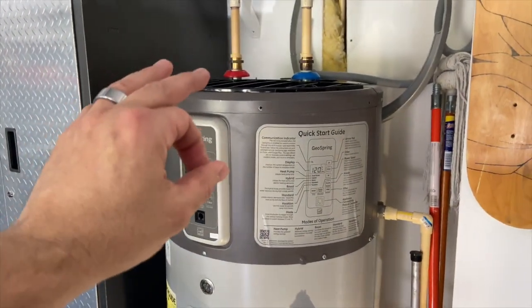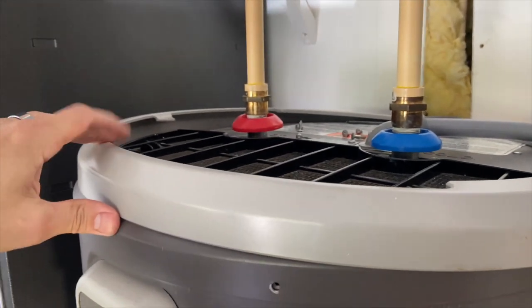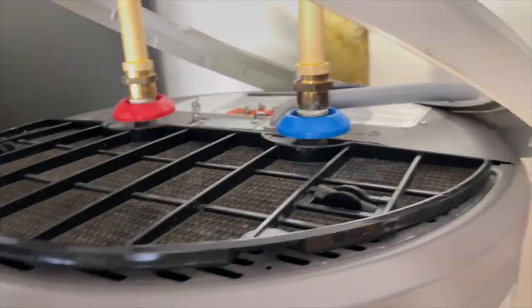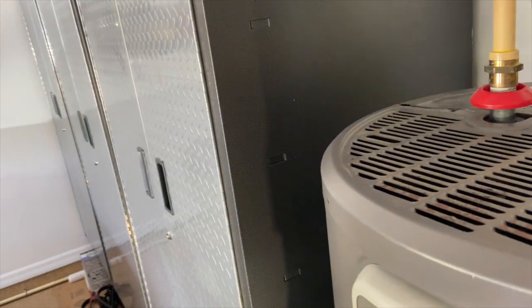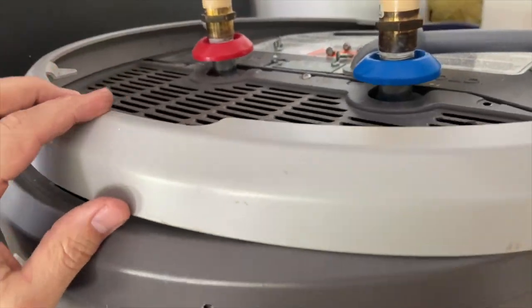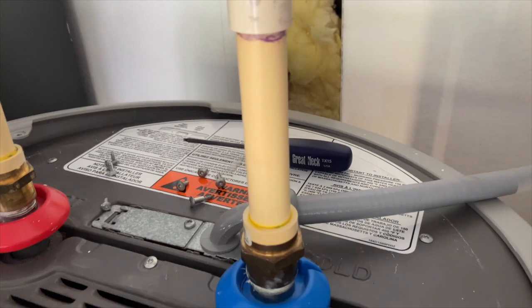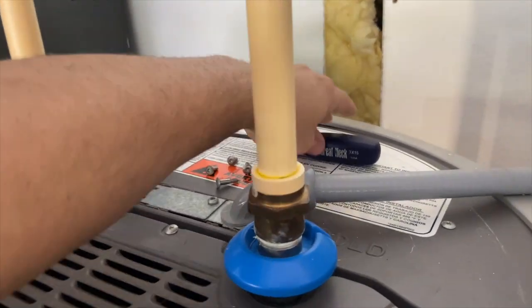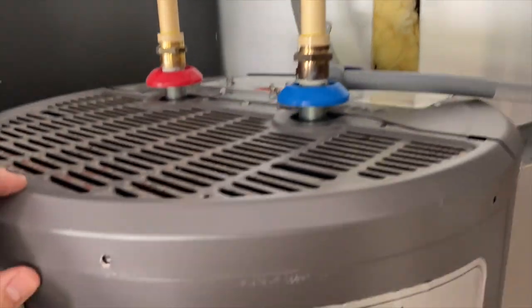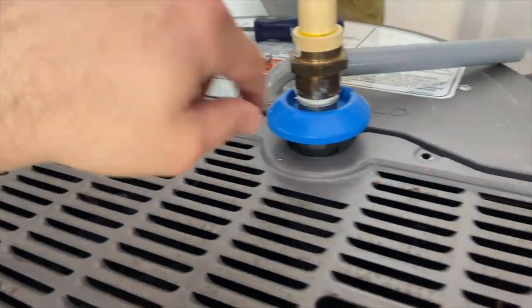I'll explain how to get this cover off — it's really straightforward. You've got this plastic cover, and there's also a filter in this space. What I would do first is remove the filter and squeeze those two little connectors to get it out of the way. The next thing is to remove this part, which is held in by a few clips around the water heater. Once you get the screws out — that's going to be a T15, a Torx 15 — go ahead and set that up and out of the way. Then remove the sheet metal screws going around the side and back.